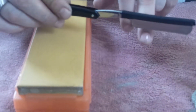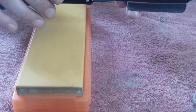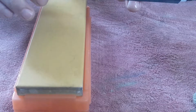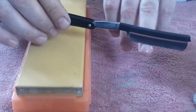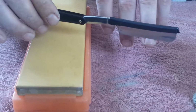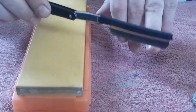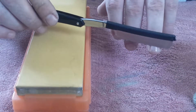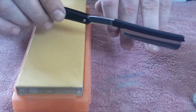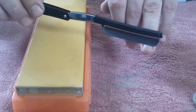And then I'll also do an angle grip test. So I'll see, with just the weight of the blade on a very steep angle on my fingernail, if it's sharp enough and the bevel set enough to keep the blade from rocking and sliding off my fingernail. So that's what I do. If it's doing that, I know that the bevel is set, because without a bevel it would not balance on my fingernail, it would not grip in, it would not hold itself from falling, and it's biting in pretty nicely everywhere. Pretty good. Alright.